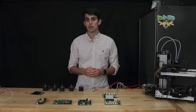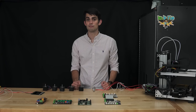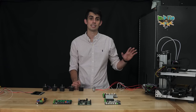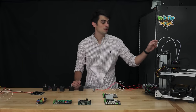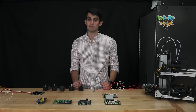When you purchase a motherboard, you're buying into one of the 10 plus firmwares that exist. While all firmwares readily support the most common types of fused filament 3D printer designs, there are subtle differences between firmwares which can make more complicated 3D printers, like Xydex, difficult or impossible to set up. Keep in mind that Xydex is an extreme example with its 2 independent Z-axes and X-axes. Printer compatibility can be easily checked on the firmware's documentation.